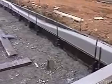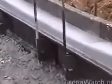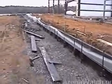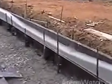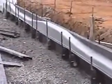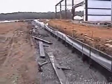And how about the different elevations? Do you do that by hand always, or can you do that with a machine too? Well, the machine does it all by elevation. We set everything by string line, and that's the elevation, and then we just set off with the curve. I guess we have some ramps shown right here for the sidewalk area or something of that nature. That's where we have those two dips, I guess, huh? Yeah, wheelchair ADA ramps.